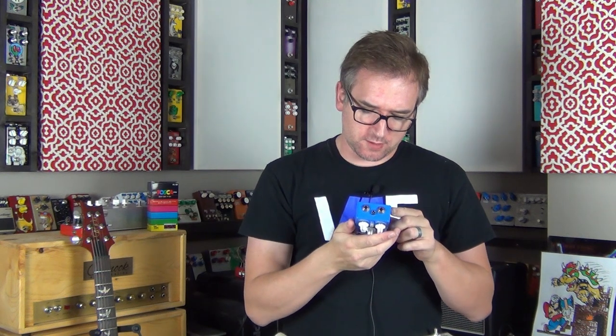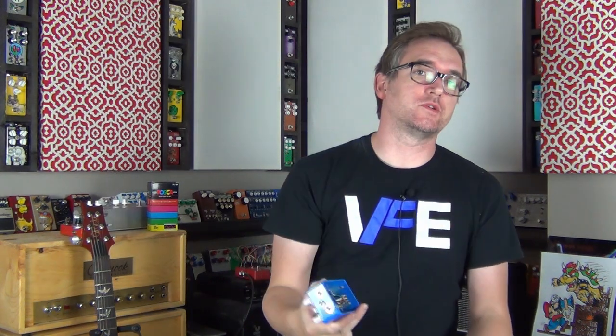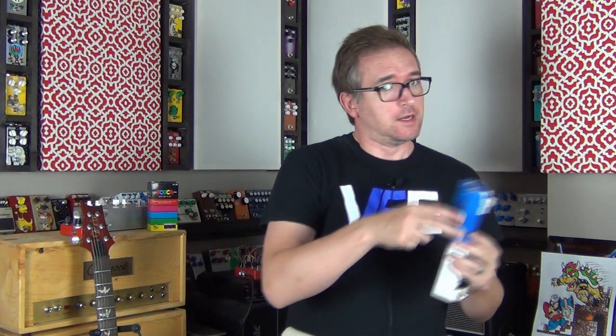For this one, I went with AC125 transistors, and I want to say I got these off of Small Bear. Now, anybody who builds fuzzes or looks into analog band fuzzes will know, you go on his website and he's got all these different options, red dot NKT275s and all this unobtainium stuff. I can't speak to how great those sound. I've played a few of them and they're phenomenal, but do they sound better than this one or that one? I have no idea. But what I will say is I think these sound really good. And it's cool, you go to Small Bear and they'll get you a matched set for gain and leakage, and it's pretty cool.